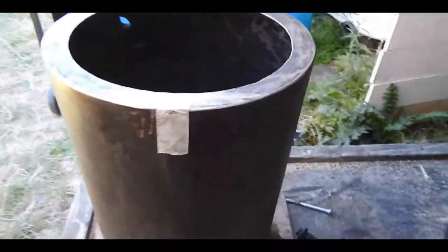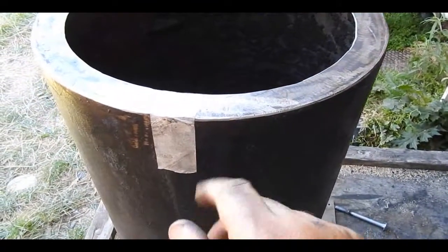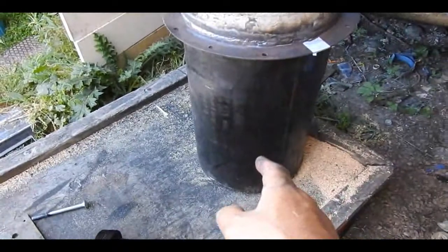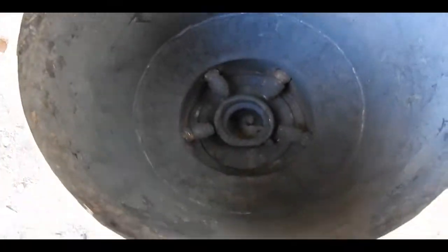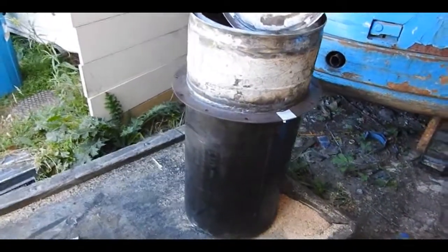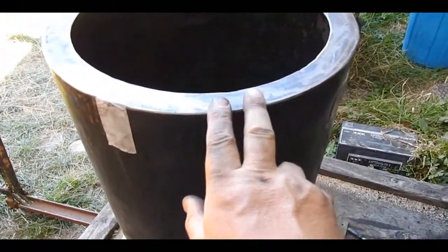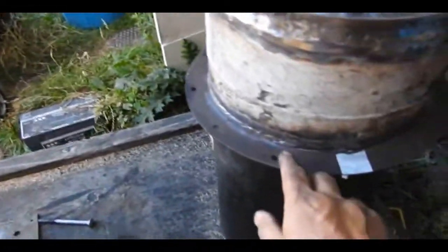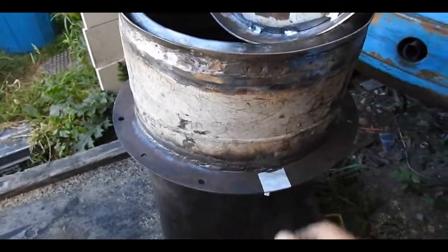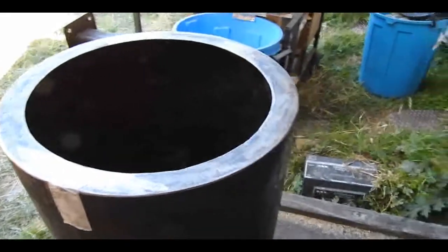Like Flasher's gasifier, it now has an outer barrel that is in no way permanently connected to the inner barrel. In the past everything was welded, so that barrel inside was the interior of the gasifier we've all come to love and know — it's now in three pieces. This bit will never be used again, except maybe to kick now and then to test my slippers. My plan now, with this flange that I've welded on, is to basically drop the cylinder into place. It will be literally glued on using high temperature RTV — not bolted, even though it has bolt holes. I figure the weight and the stickinessity of the high temperature RTV sealant will be just fine for holding it in place.